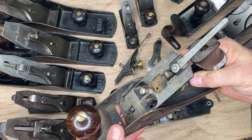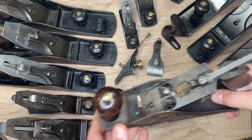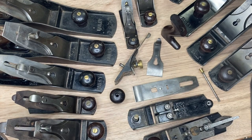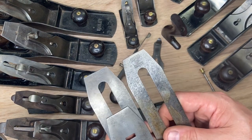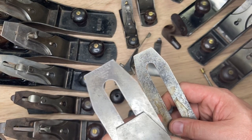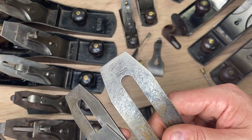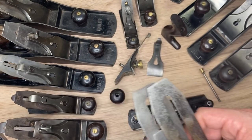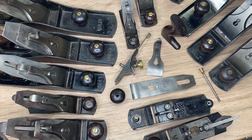So those are your two major differences you can see right away: high knob versus low knob, and the size of that brass blade adjustment screw. The last major difference, if everything on the plane is original, is the logo — your type 11 is going to have the V logo, and your type 12 is going to have one of the sweetheart logos. This first sweetheart logo goes on your early type 12s, and there can actually be one of three different sweetheart logos on type 12s. I did a whole separate video on just the sweetheart logo.